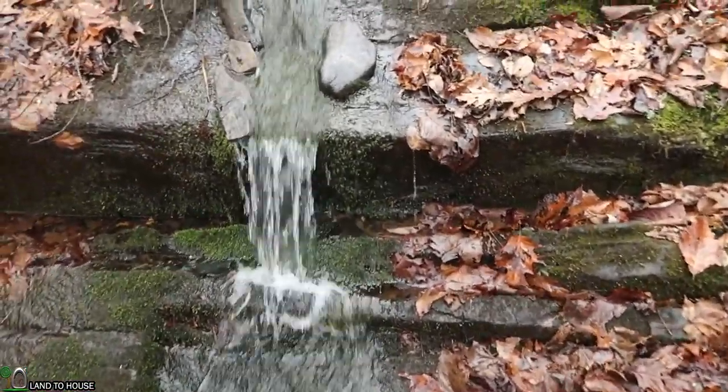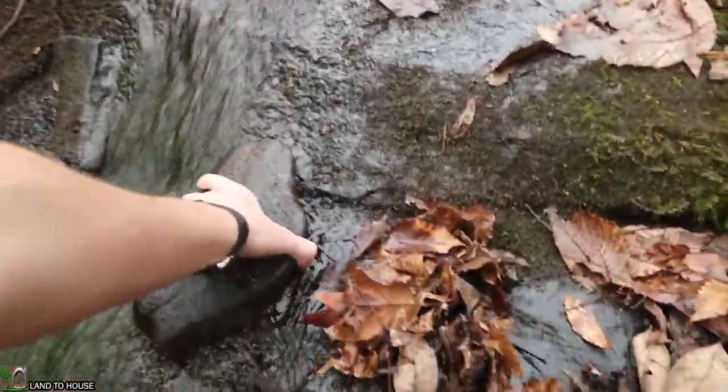I should be able to capture this water and have basically its full potential in that two-inch pipe. I'm going to come back up here in the next couple of weeks and continue to test this flow rate. I may go ahead and store my little rocks off to the side so I can do this same thing later and capture more of a steady stream. The main thing I want to see is how the water slows down, especially in the summertime. I anticipate the creek drops down to about 10 gallons a minute in the middle of summer, which is still going to produce at least 200 watts of power consistently.